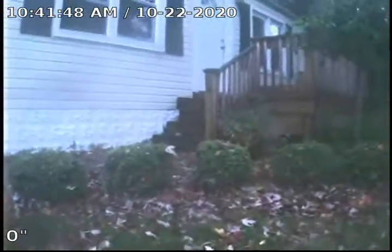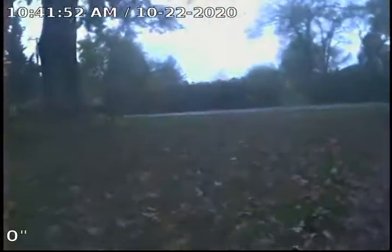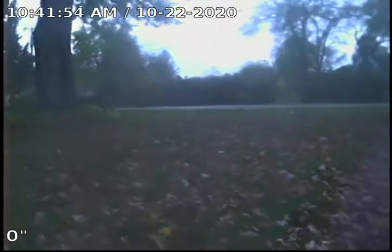There is a PVC cleanout that's up under the deck here. There's also one, it's probably going to be hard to see, but it's that white spot out in the front. The sanitary sewer for the bathroom comes out the other side of the breezeway in cast iron. It goes out the wall, and the kitchen stack is right on the front wall of the house.